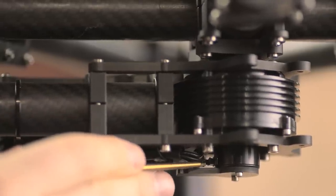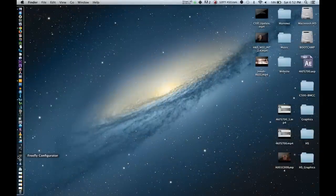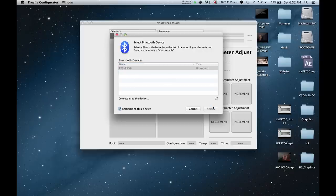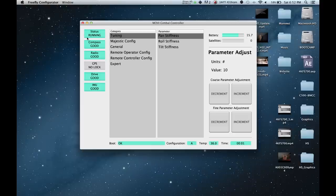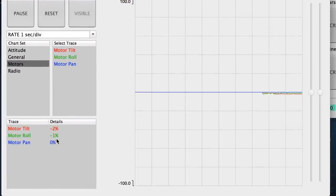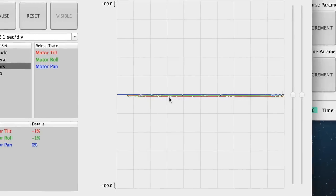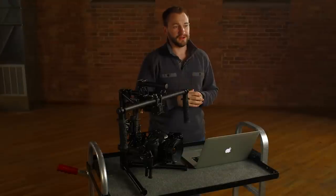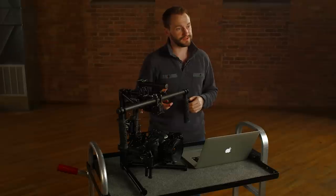Typically the pan motor will become disconnected when balancing the pan. Once powered up, you'll pair the Mobi as a Bluetooth device. You'll want to get a sense for how well your balance is by opening the chart and going to motors. The Mobi is at rest, so this will show you how hard the Mobi needs to work in order to maintain balance. Ideally these should all be zero with perfect balance, but an acceptable threshold is up to three or four percent. If you're seeing numbers above this, you'll want to power down and give balancing another go. Good balance is very important — the better the system is balanced, the less the motors will have to work at rest, which means batteries will last longer. Additionally, you'll be able to tune the system to higher tolerances, meaning better performance overall.